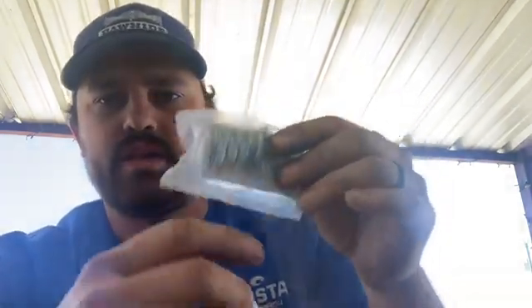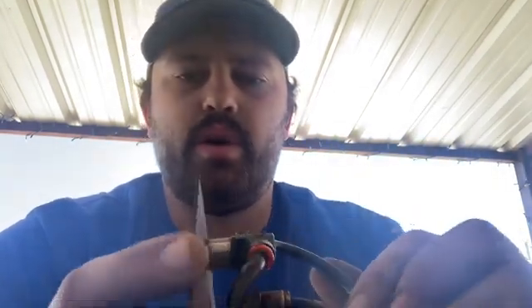So today we're actually going to be doing some AFC tuning. I'm going to be installing a max travel spring that's good for 60 PSI, then I'm going to be shaving the AFC foot and installing a home-built AFC control that I can control from inside the cab. Most of you know this as AFC Live, but I don't warrant spending $400 on something I can build myself with some parts off the internet.